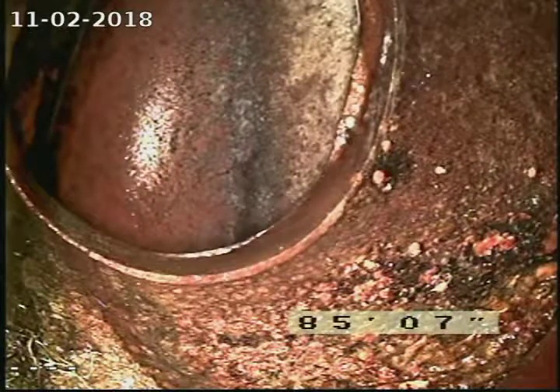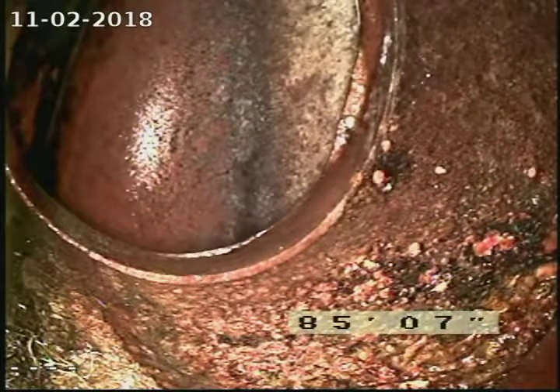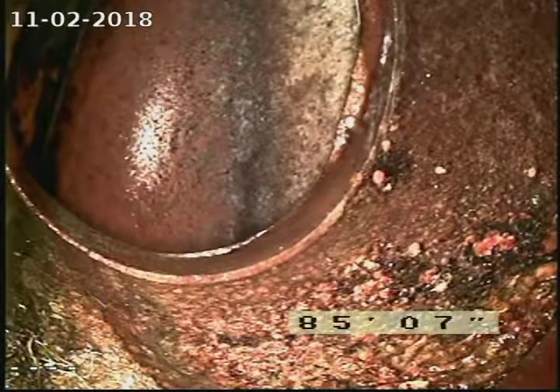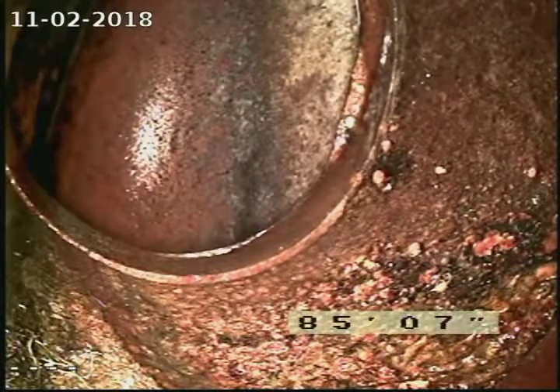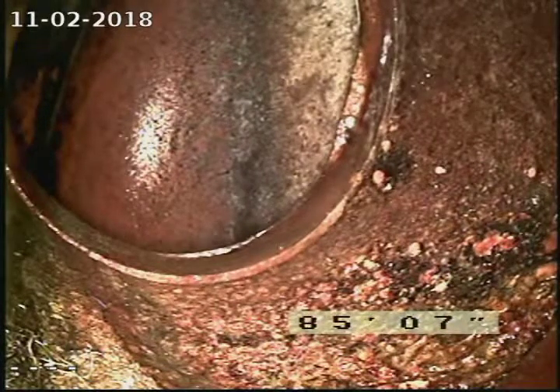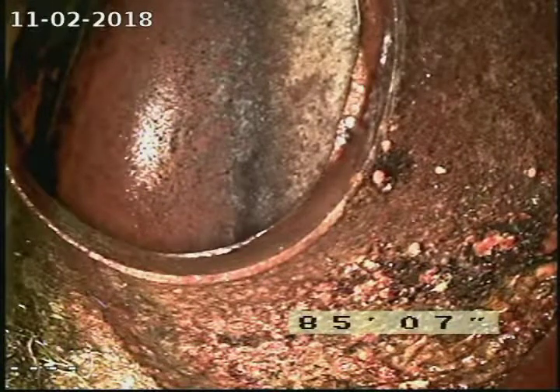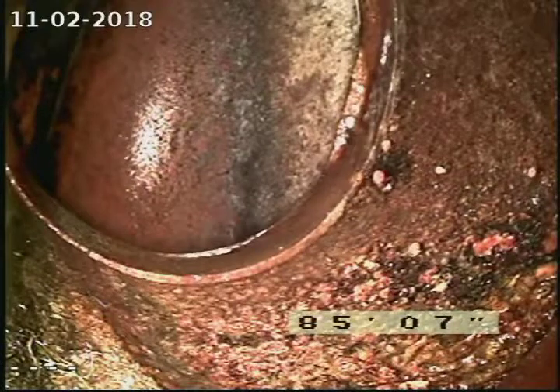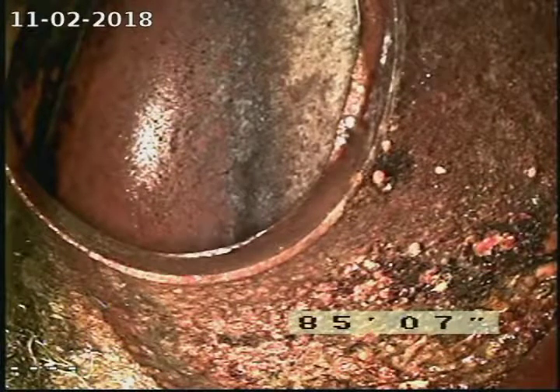The city connection is in good shape. There were massive roots inside this pipe, so we had the cable and flex shaft them out of there. The roots did compromise the pipe and are growing through and pushing through, causing structural failure on the clay pipe, so we'll be able to see that on the inspection on the way back. What we're looking at here is the city connection and we're going to be heading back towards the building up through the clean out.